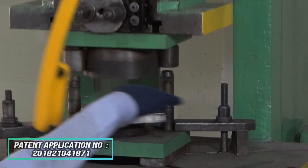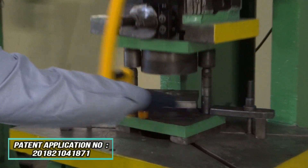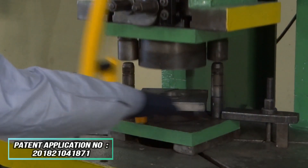The Hand Savior is errorless as it is ram-actuated. Every time the ram descends, the swinging arm safely pushes away the operator's hand out of the press machine, avoiding any hand or finger injury.